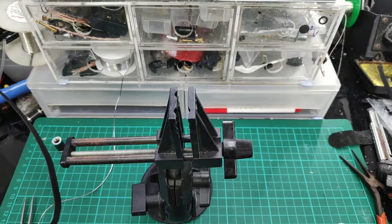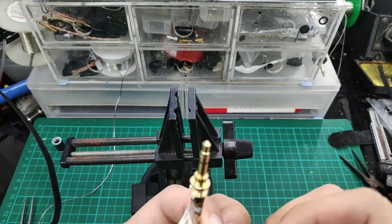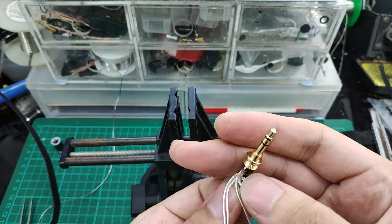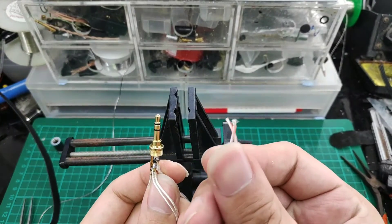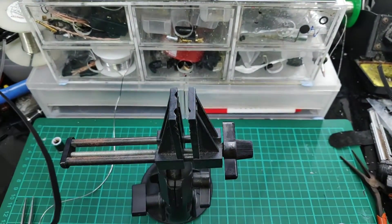So if we are doing the 8-wire cable, we are going to have 8 total conductors. I have already soldered the wires — let me show you the configuration here. We have 2 wires going to the tip and 2 wires going to the sleeve, so these 2 are the left and the right. For the sleeve, the right side, we label them as red color, and for the left, as blue.